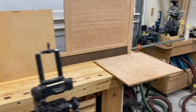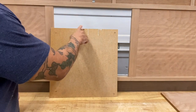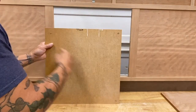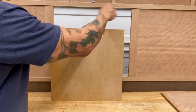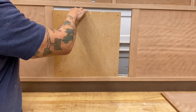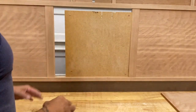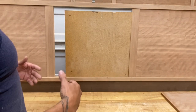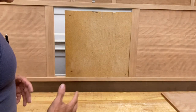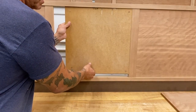I'm getting ready to fit the panel to the middle section of this footboard. I've made a square reference and marked it top. I know that one corner is acute as is that opposite diagonal corner — acute — and then of course these are obtuse, slightly open. The panel wants to fall if I put it against here — it's contacting here and there with a slight gap. I can use that as a reference to start cutting the panel. I should have made this during the glue-up, but no big deal, it'll be easy to fit with this reference panel.